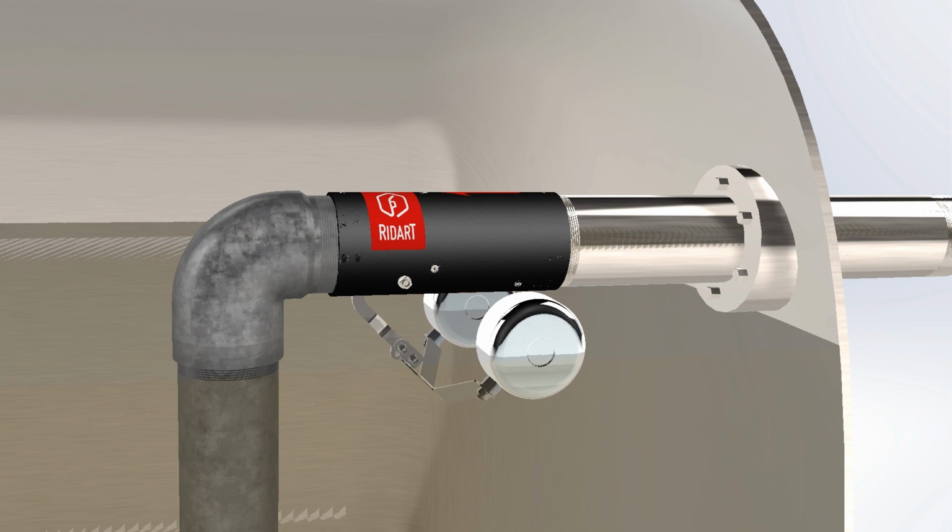For highly turbulent flows, the valve closes at a lower level. The value is indicated in the technical datasheet as initial closing level. This happens because the force of the fluid pushes the valve retaining plate and closes the intake.